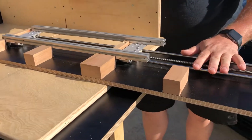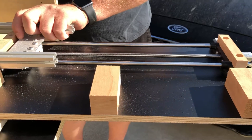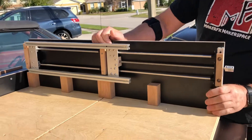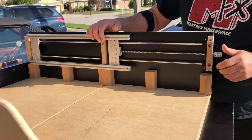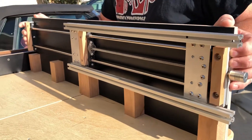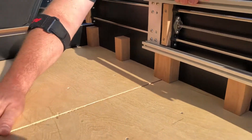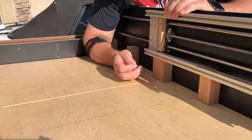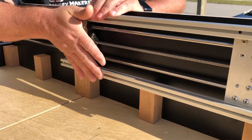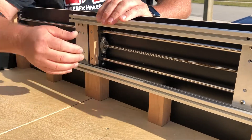This is using linear rails from a 3D printer and some extrusion. I'll do another video on this later to give a better depth of concept, but this just bolts up to the front of any crosscut sled you're going to put on your table. There's going to be a stepper motor attached here. The clearance on this is set so that at the blade's highest point it still will not come into contact with any of this. There will be a cover that goes across here so that the face of this will be at the same level as a piece of plywood, giving you a zero-clearance gap.